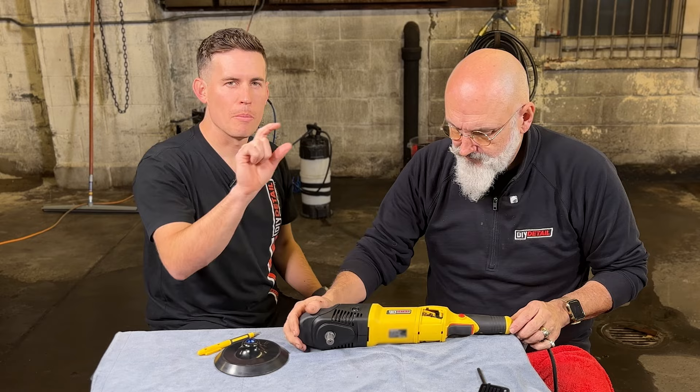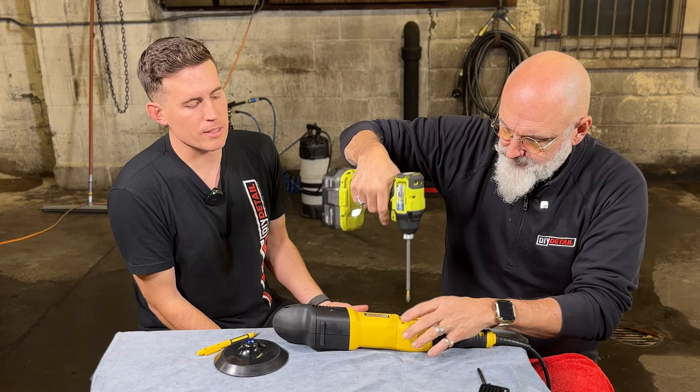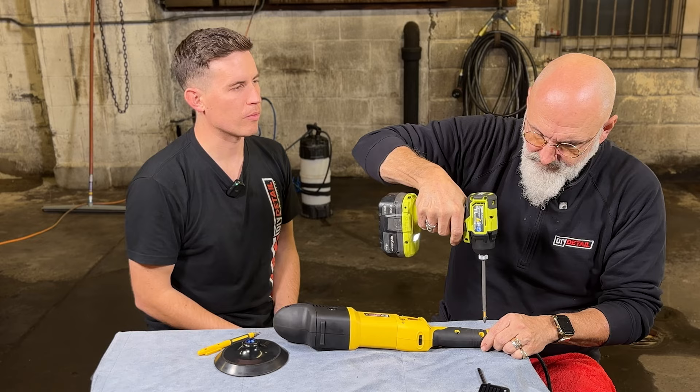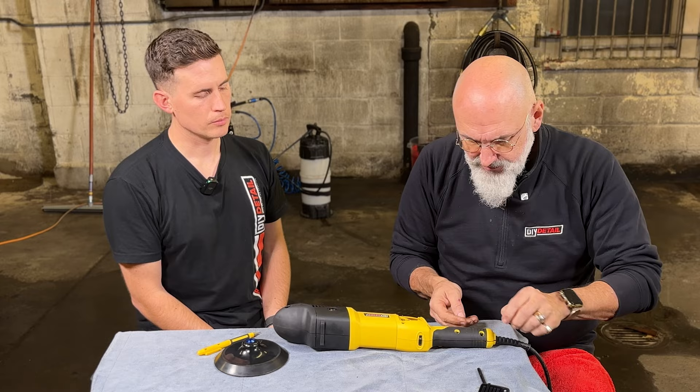From cord to brushes to grease on the machine — the service video addresses all the different ways to take the whole machine apart. Common wear items on a tool are the cord, the brushes, and the switch. Changing the grease in your gear case once in a while is also always a good thing. Grease, just like the oil in your engine, is not for life — it eventually starts breaking down, so you want to make sure you have good grease.